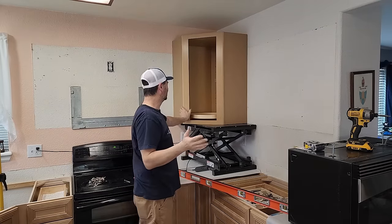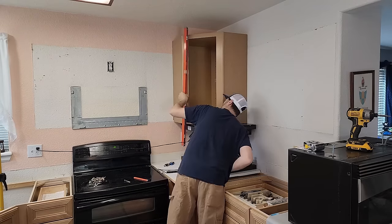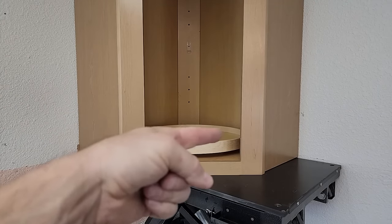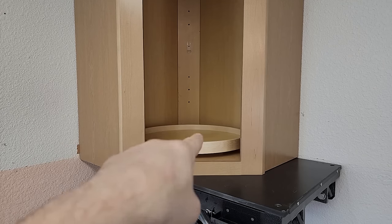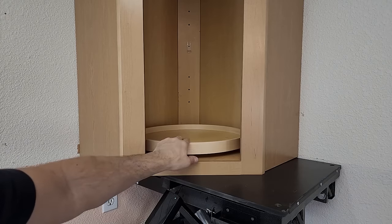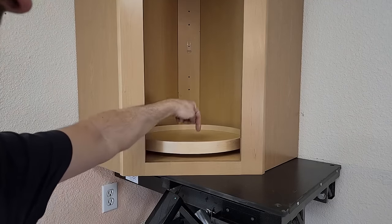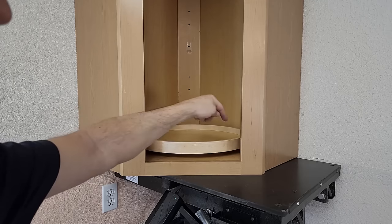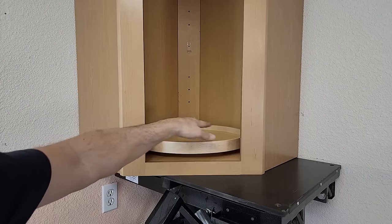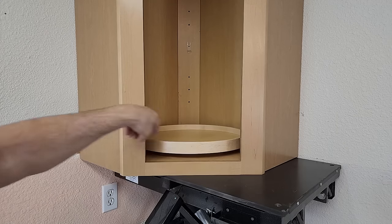Can it be that easy that I just take measurements and zip, zip, zip it in? I need to screw right in there in the back. 12 in, I think it's 3/4 inches over. And then this one is 16 and 3 inches. No, 12 and a half and 16 off the wall. Well, that's right behind this spinny thing here. You guys see that plug right there? They got a plug in here. You got to pop it up with a knife, and that will give you access to the screws that screw this to the cabinet. And the only way to install this cabinet is to remove this, because it's the only way to get access to that strip of structural backing that is around the bottom of the cabinet.